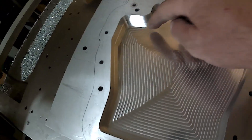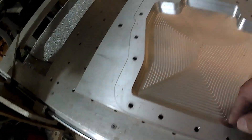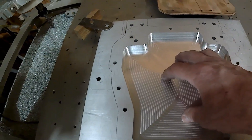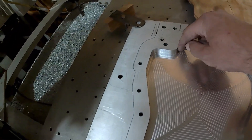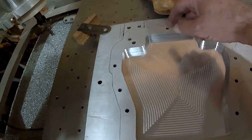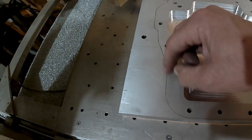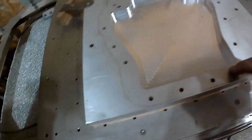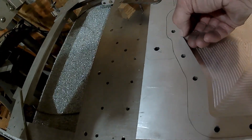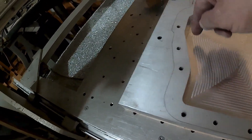You can see all the little lines in that video. It comes in and starts in the middle and works its way out until it gets all the way to the outer edge. This is a pocket cut. I'm going to come in and do a profile cut where the end mill will come in. I've left 25 thousandths — I thought it was 10, but there's 25 thousandths extra material on this original drawing. Because I'm not cutting material on the outside to make a thin rail, this whole thing is going to end up three-quarters inch thick all the way around. So I can actually take this in almost another 100 thousandths of an inch.